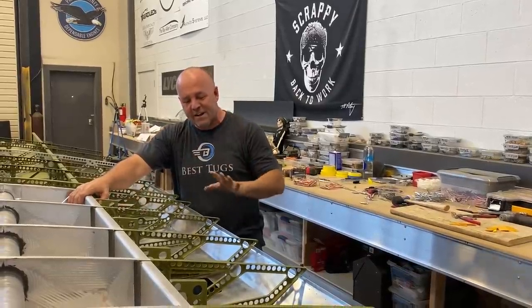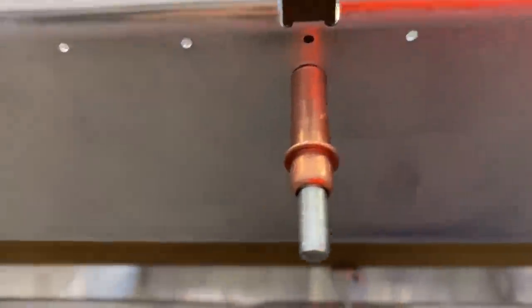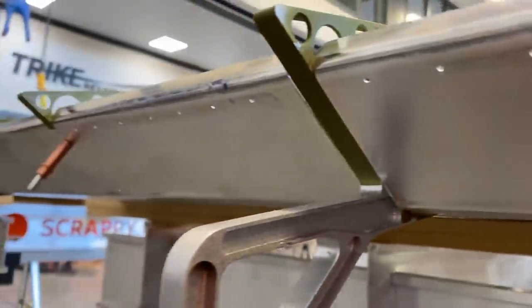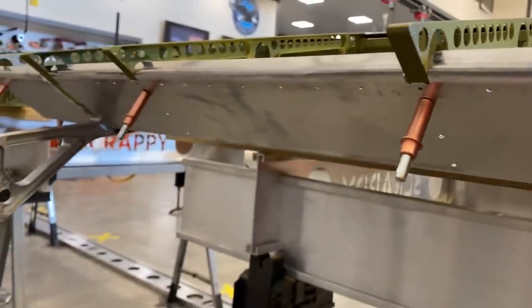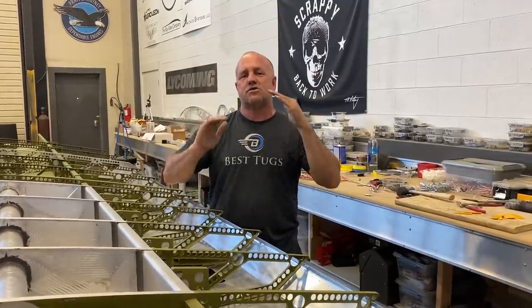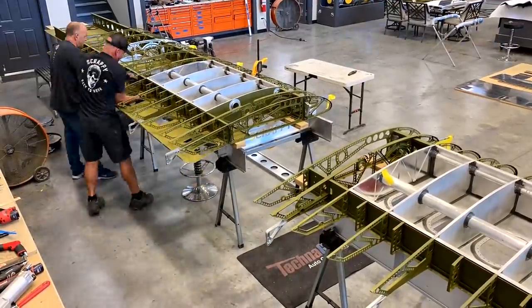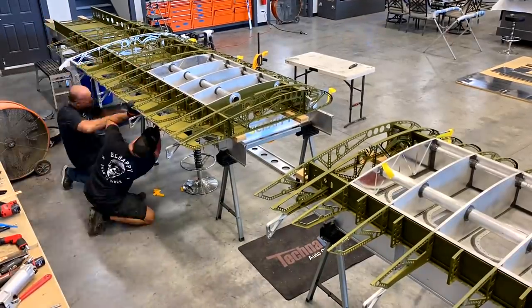I mean, it works fine, but this little simple step of putting this bend on here makes this so strong that when I bring the other side around and hook to it, and I run the rivets together, there's absolutely no way for that sheet to wave. So it's a little more work, 10% across the whole wing, but every single joint, whatever is the underside skin, has got a return on it, and it's flattening out all the seams.